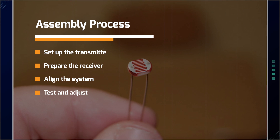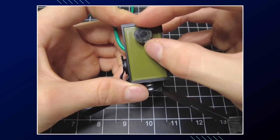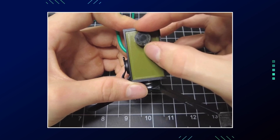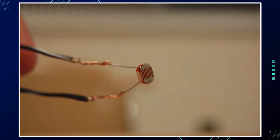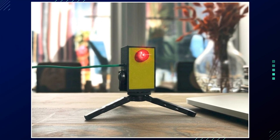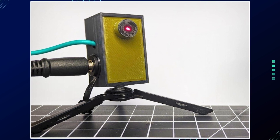Here is basically how it works. The laser microphone converts vibration into sound through a multi-step process. A laser beam is directed at a reflective surface such as a window that vibrates due to a nearby sound wave. As the surface vibrates, it causes slight deflections in the reflected laser beam. A photodiode or photo cell in the receiver captures these deflections, converting the oscillating laser signal into an electrical signal.